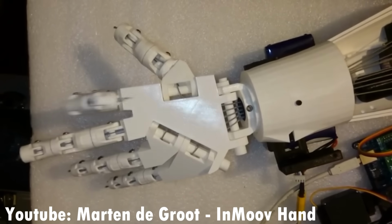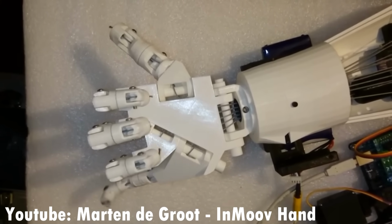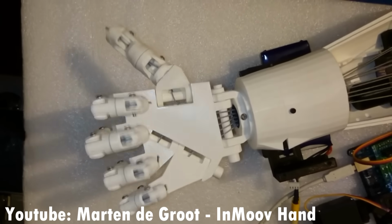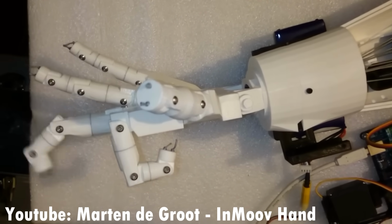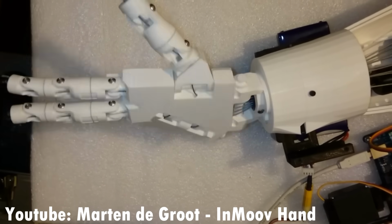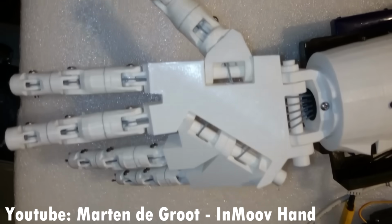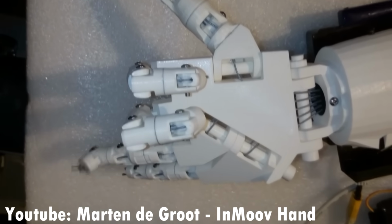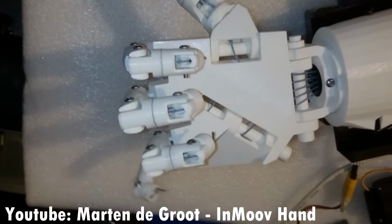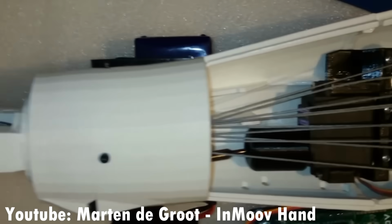But yeah, that's something that I could probably just get rid of, honestly. I have seen bionic hand designs that integrate one or two hinges in the palm, which combines the motion of moving the metacarpal bone with the inwards twisting that I was describing earlier, and it does allow the little finger to oppose the thumb more directly. It's something that I need to research in more detail.